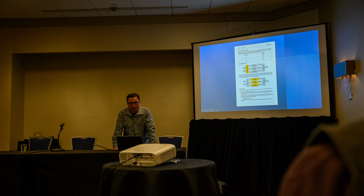Okay, so Dan Clark, SoCal, a lot of these companies, they do multi-parameter driver matching, so they're going to get similar matching results. The pads throw something into it. The reason the HD800s and HD800Ss are particularly good for this is because they have low deflection ear pads. Ear pads can wreak havoc with position. You have to get it just right. So measuring both ears at the same time helps, because then you can monitor both.